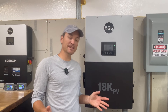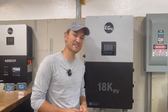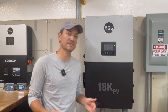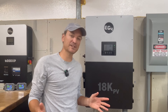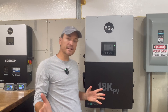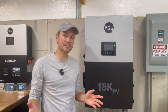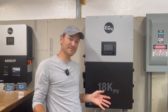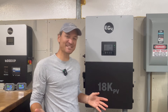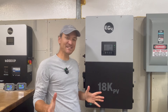I would highly recommend investing in quality surge protectors. This is definitely a wake-up call for me. Hopefully in the next couple of weeks I'm going to be installing a surge protector on the house and you guys can see how I do that. Both the EMP shield and Midnight Solar units stand out — those are the ones you see most often. It seems like an expensive investment at first, but it's much cheaper than investing in an entire system again. I wouldn't consider our area extremely lightning prone, but I think it can happen anywhere. I'll leave a link to both units. The install is not difficult — it's red to red, black to black, and you give it a pathway to the ground. We're just extremely thankful it wasn't worse. As close as it was, it could have been a lot worse. I think we were extremely blessed on that one. Thank you for watching and stay tuned.